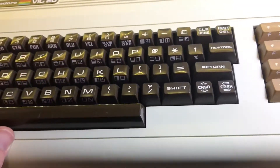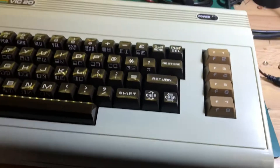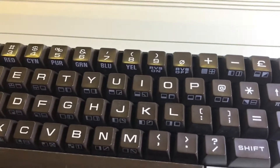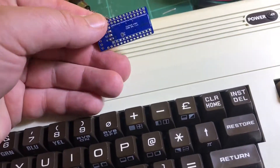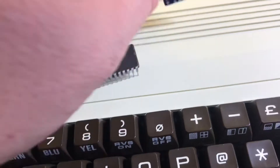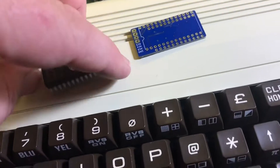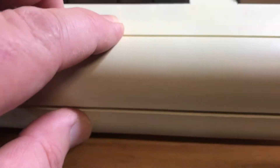The problem is in the VIC with the PET-style keys — there's my Jiffy DOS original kernel and it just, because of how the keyboard is, just can't close it. So I'm not going to be using that. I'll just have the normal PAL kernel in Jiffy DOS. So once I've programmed the ROM I'm not going to take it out and reprogram it. I'm going to make up a new one and just have the ROM straight on there, which should give me a few extra millimeters of clearance so I can close this.